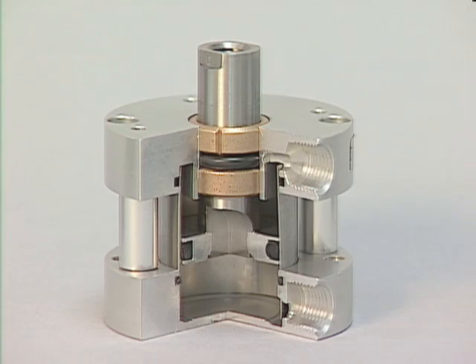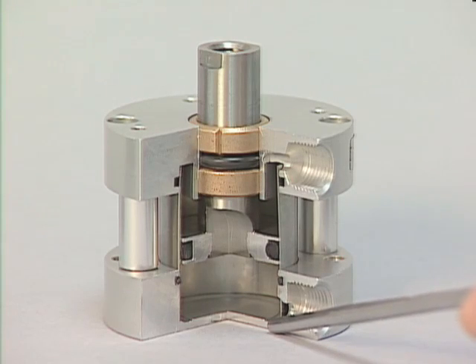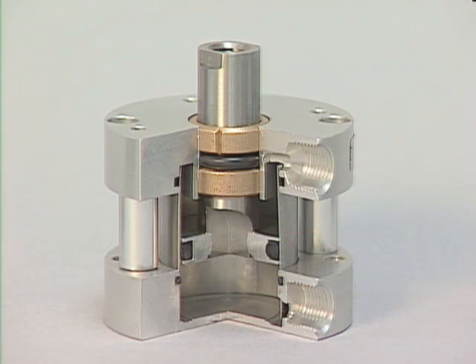Take a look at the competition's rear cover. The rear cover is thin, and the air enters the cylinder through a milled relief, weakening the already thin cover. That makes for an even weaker point under continuous cycling. When the cylinder is mounted on the rod end, you get a coining of the rear cover, resulting in breakage of the rear cover and allowing air to release — total failure of the unit.